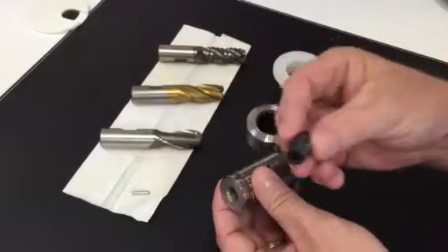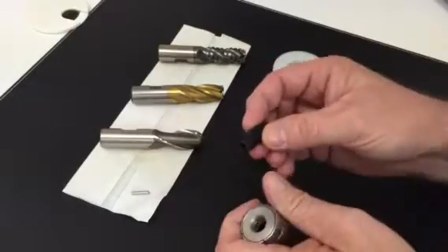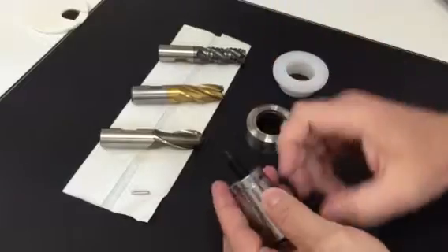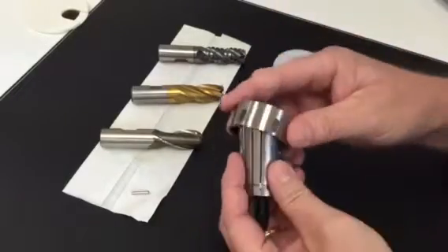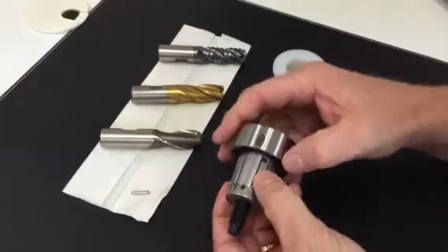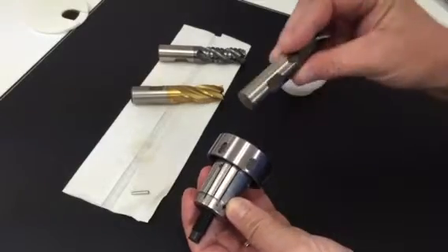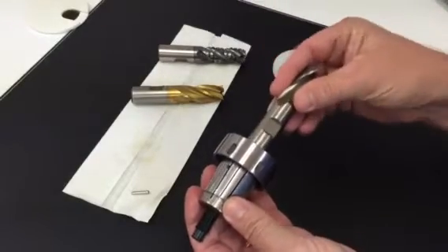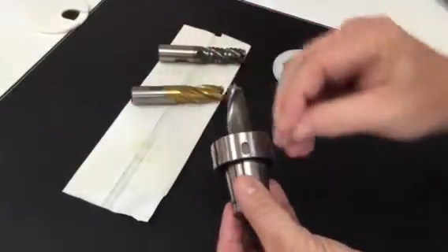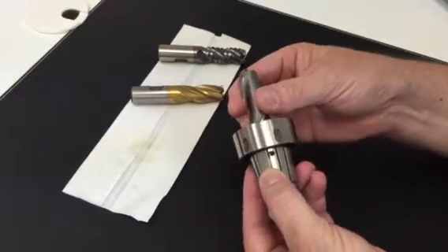The preset screw is a nylon preset screw with an o-ring to give it some flexibility if the tool draws. We just start the preset screw in there, then use a mini nut so that the pin is accessible. We take and put our pin in this orientation, take a standard cheap end mill, slide it in, and take our dowel pin — this is a three millimeter hardened dowel pin — and slide it in. You see it drops right in.